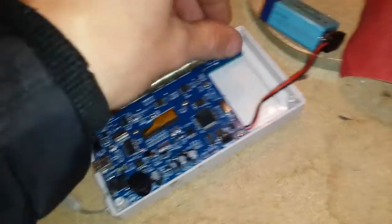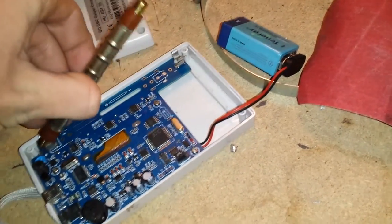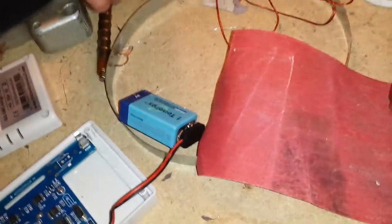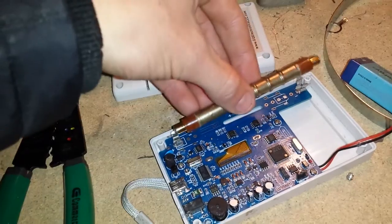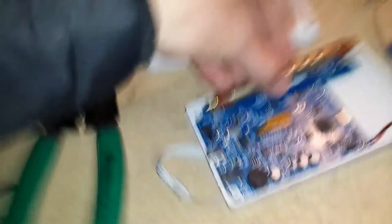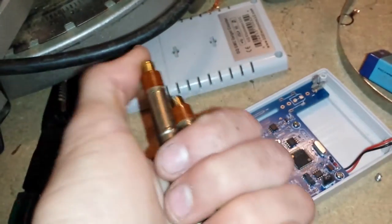Broken anode. I don't know how he's testing them, but they're not good tubes. The first one just shorts it out — see the red light just staying on there. So yeah, they're both crap. I think I'm probably just going to end up getting a refund from this guy. These are $10 tubes, at least that's what they were listed as on his eBay forum.